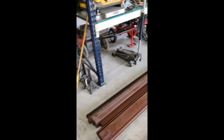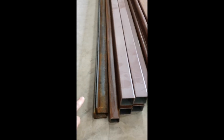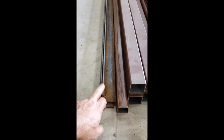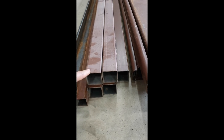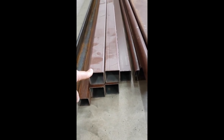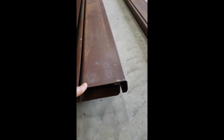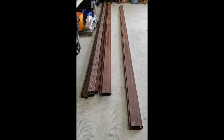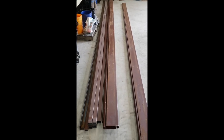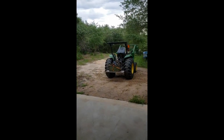To do that, I have all this metal here — all 20 foot long. I've got two-inch quarter-inch angle iron, which will be the rails that everything rides on. Some inch-and-a-half for bracing if needed. I've got two-inch, 14-gauge tubing — a little thinner than I wanted, but for my application with bracing it'll probably be fine. The structure itself is going to be made out of six-inch C-purlin. I'm trying to keep the weight down because I want to be able to move this thing with just this little tractor — I can't make it out of channel or tube steel, otherwise I won't be able to move it.